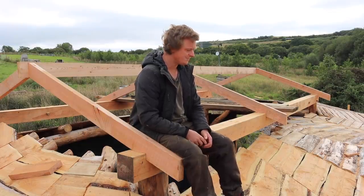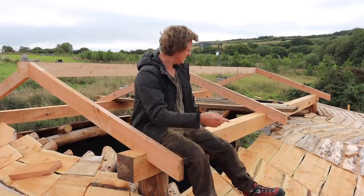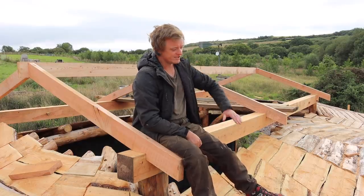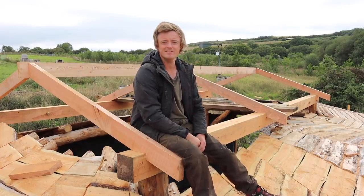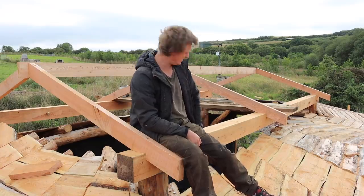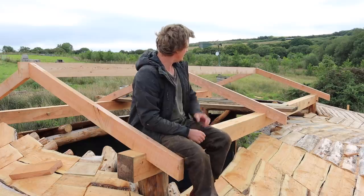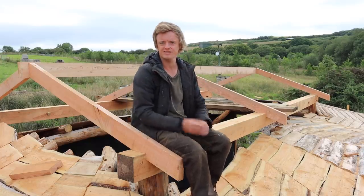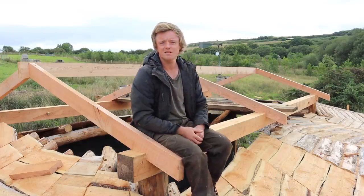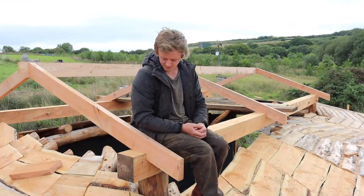and then that will resist those forces outwards. Because obviously it will be tied to these rafters, which are then tied to the walls and tied to the big piece of timber underneath them. And then there'll be the weight of the turf and everything on that as well, and that will be considerably strong then, plus the ability of this beam to hold, which is a 6-inch wide beam. So yeah, that's how I'm going to contend with that. The type of join I did, the scarf join, is not particularly good at resisting loads, so that's another reason why I have to do it. So yeah, that's what we're going to do with that.